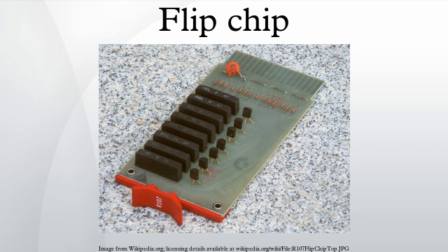In typical semiconductor fabrication systems, chips are built up in large numbers on a single large wafer of semiconductor material. The individual chips are patterned with small pads of metal near their edges that serve as the connections to an eventual mechanical carrier. The chips are then cut out of the wafer and attached to their carriers, typically via wire bonding such as thermosonic bonding. These wires eventually lead to pins on the outside of the carriers, which are attached to the rest of the circuitry making up the electronic system.